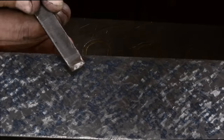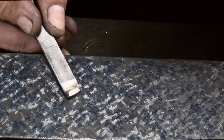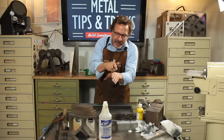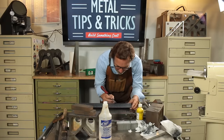If we take one of these spots in this area, you'll see that there's a dark rim around it and the height, and in the center, it's thin. It's thin because that's a high point. So you gotta think of it as a mountain where when the blue touches it on the surface plate, it actually squeezes out and goes down to the side. And that's what we're seeing here.